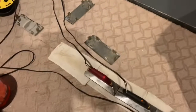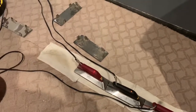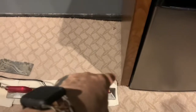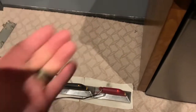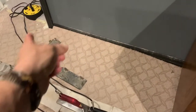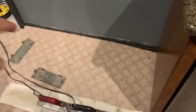What I'm doing now is I put tape down on the front side — I'm going to seam that in and let it cool. I cut a chunk out and went around that corner with it. Once this is seamed in and cool, I'll pull this back, take the carpet up underneath, lay that piece back, seam it in, then tuck it in, cut it off, and go to the next room to nail in the tack strip.